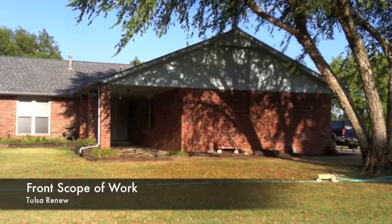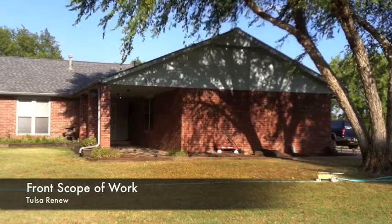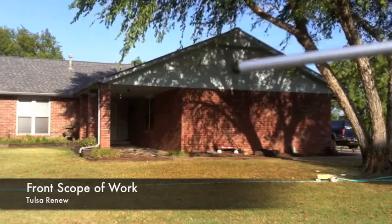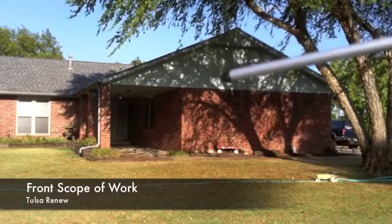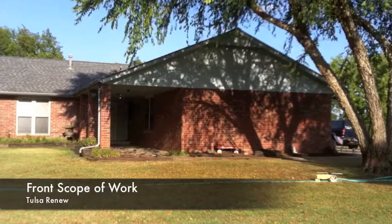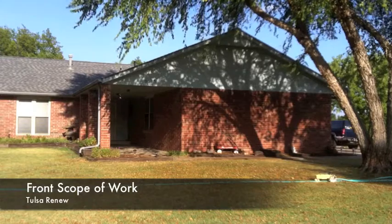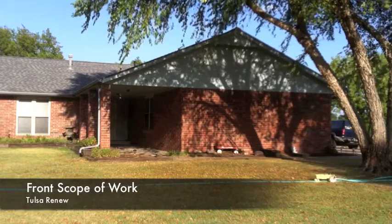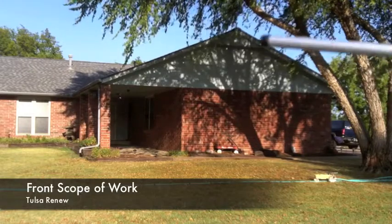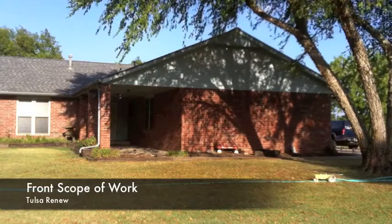We'll take the storm door off and reinstall the storm door after we apply the trim around the door, which will be hardy plank. If you want, just let me know and we'll take this box out and put in 18x24 gable vents. They'll be louvered, and we can coat them. I get a coated galvanized so that the paint adheres really well to the aluminum louvered vent. So it's a real nice kind of update for the soffit ventilation, and I believe it'll give you a little bit better through ventilation for the attic area.